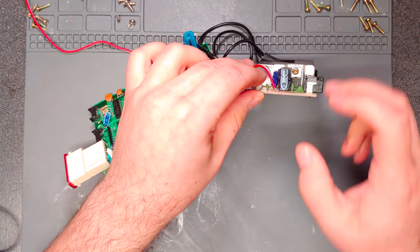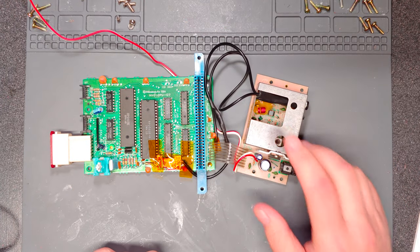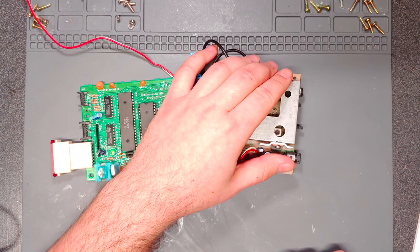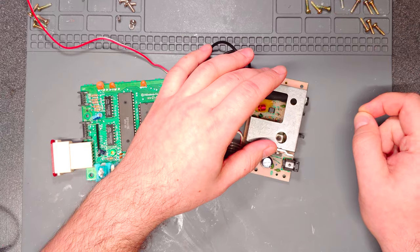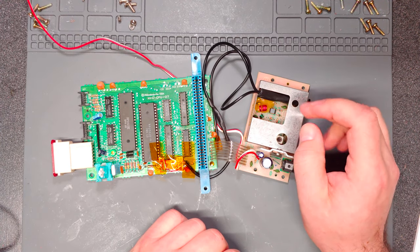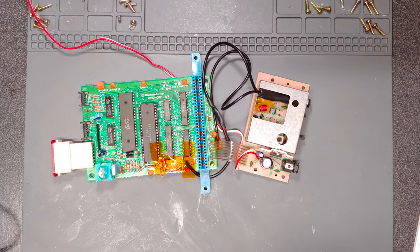The 7805 had this little heat sink hooked up to the RF modulator for additional heat dissipation. It was a pain to get out, but I managed to remove the RCA jack by using a lot of desoldering braid, and finally at the end just heating up the can itself and pulling it out. Tried that at the beginning and couldn't get it out, probably because of all the solder. At first I thought it might be welded, which would have meant having to destroy the RCA jack — not that you can't find replacements, but it would have been nice to keep the original.